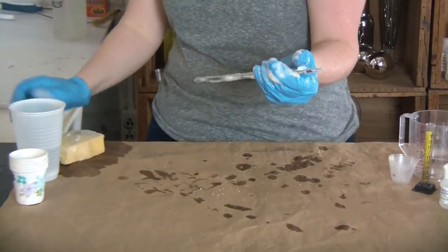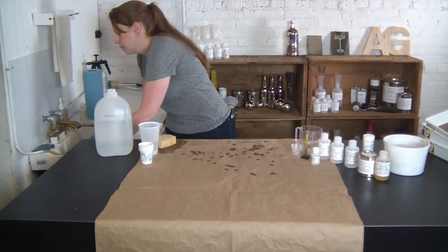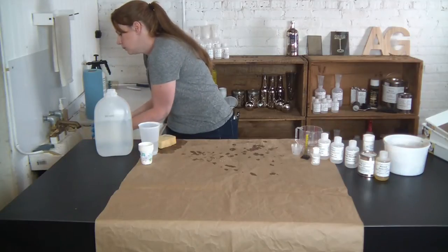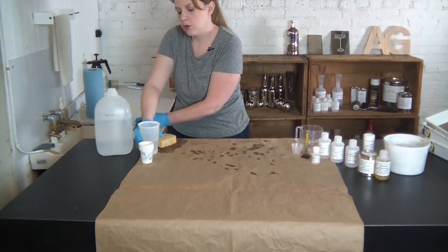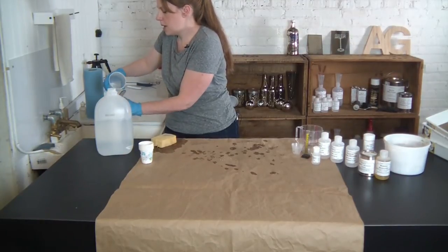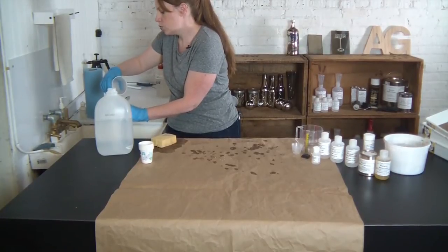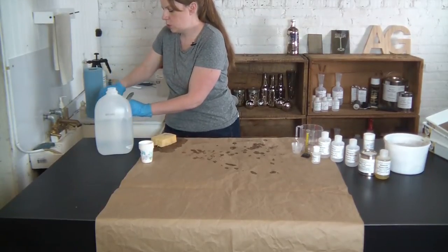I'm pretty happy with that. I'm going to go ahead and rinse it off with some warm tap water. And now once I'm done rinsing with tap water I'm going to go behind it with some of that distilled water, rinsing the surface. What I'm looking for — a way to know that it's really clean — is that the water is sheeting off the glass, really just running right down. It's not beading up at all, which means my chemicals will run right over the glass as well.